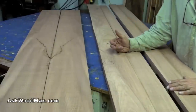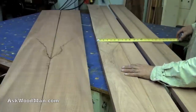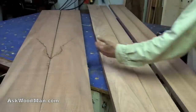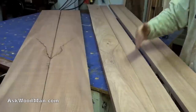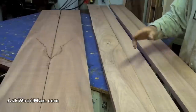I can't pass more than 12 inches through my planer, but I know I can pass each glued-up panel through and have everything flat and straight with that seam perfect. When I join them again it'll be a lot easier than trying to manage three seams — I'll just be able to plane two of the seams off and only have to deal with one by scraping.